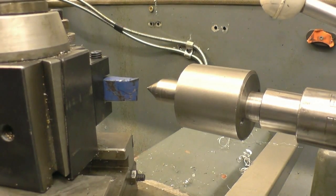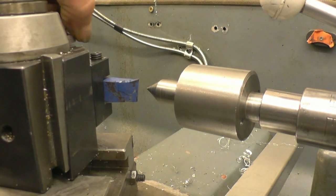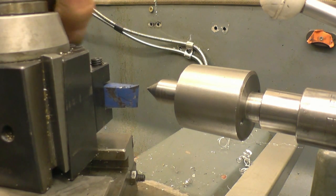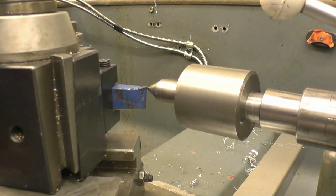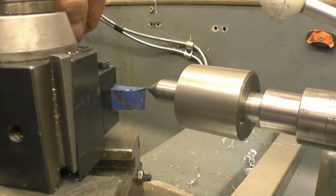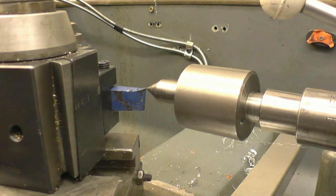There are a few different ways of setting up the lathe tool center height — you can see that one's way too high. What I normally do is get it just set to center and then take a facing cut across the end of a piece of bar. That gets it absolutely spot on. Still high. That looks pretty good at that — we'll tighten it up and give it a try.